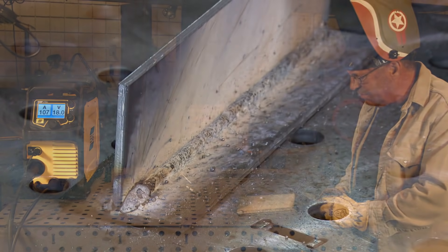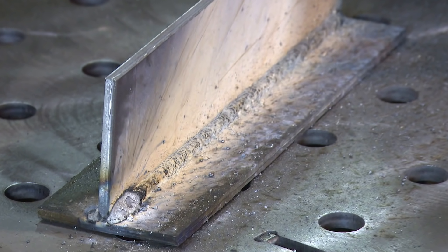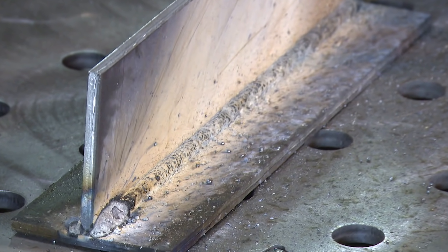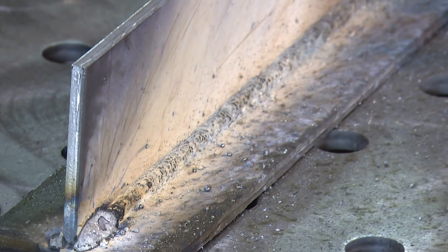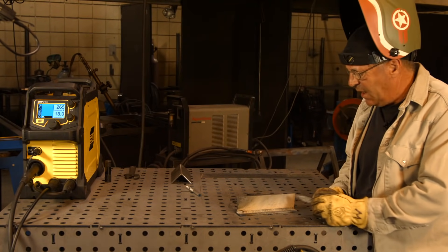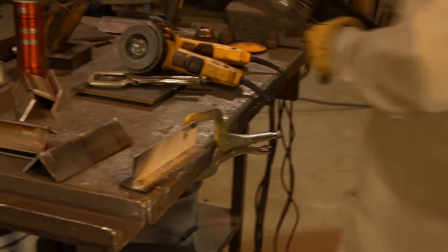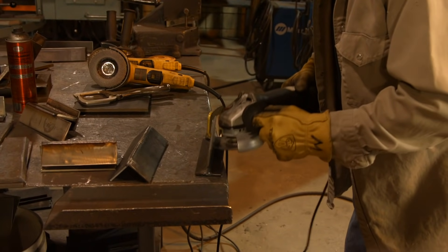As you can see, that looks kind of nasty — it's got a lot of spatter and I really don't see a weld bead at all. You're probably thinking you did something wrong, but that's not wrong. That's just the nature and the arc characteristics of this particular wire. I'm going to clean this up. The first thing I'm going to do is put a wire wheel bead brush on it. I may have to sand some of the heavy spatter off of it, but I don't think I will.